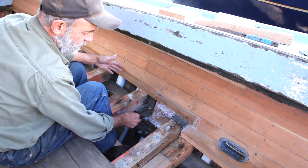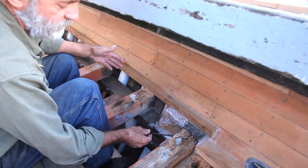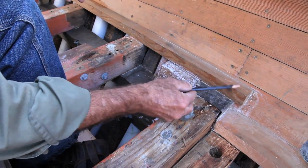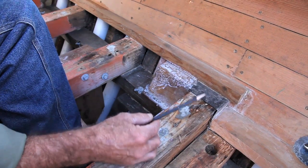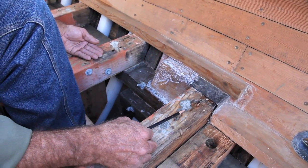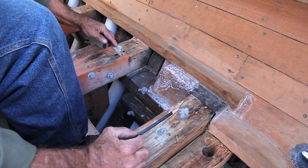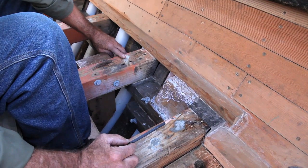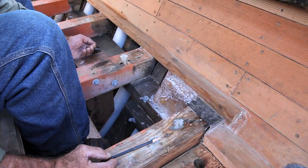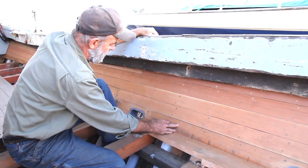All of this area has got all kinds of little auxiliary blocking that supports the ends of the deck. This deck timber right here is eventually going to be replaced, and it only butts into this block right here so that it can be taken out without disrupting all of this work. The work in this area forward and aft is designed so that we can remove the deck again later and replace some of these deck timbers without disturbing anything. That's why I haven't covered these bolt holes here — they're filled off with a little bit of Portland cement without sand as a filler so they won't hold water, but will be exposed when the deck comes back up.